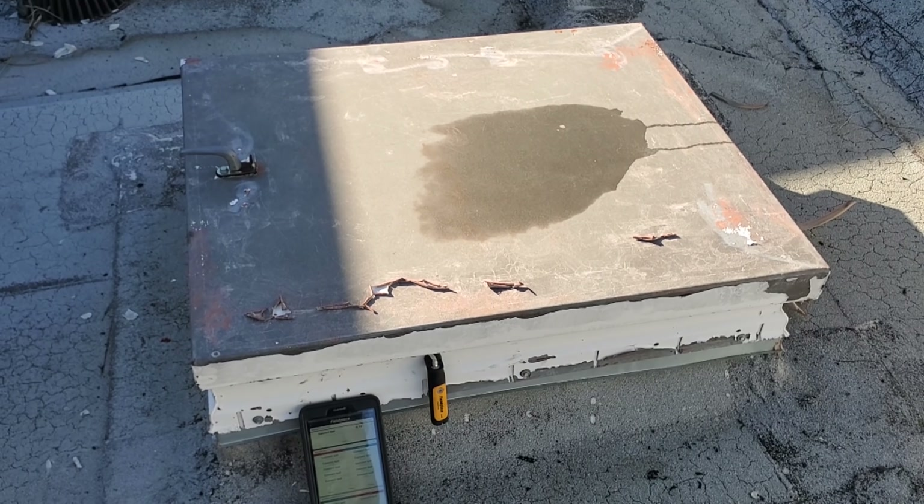New pulley's on. Notice you can't see my lines anymore where they were earlier — that belt was massively stretched out because I put the same size belt on and had to move this up a good half inch to three quarters of an inch to space it out. I also found that they did not have the pulley centered. I used an eyeball and some reference points — I know people will give me crap, but I can do a pretty good job that way. I ended up moving the pulley out a little bit to line it up better. We've got good tension, it's riding in the pulley properly and evenly on both top and bottom. Tightened everything back up, did my measurement check, and we're good.